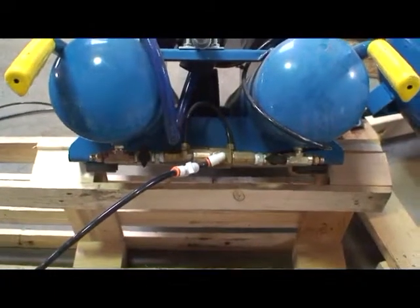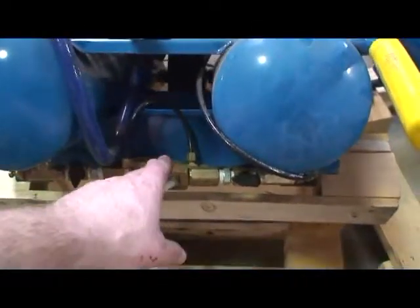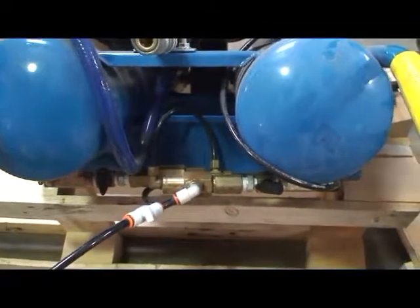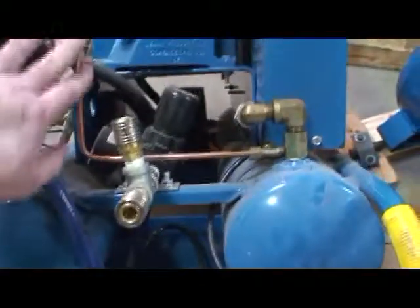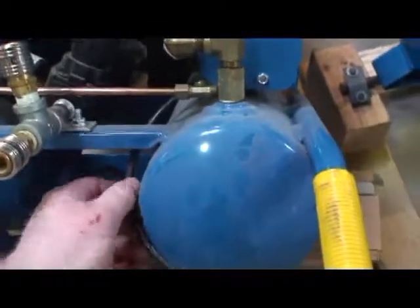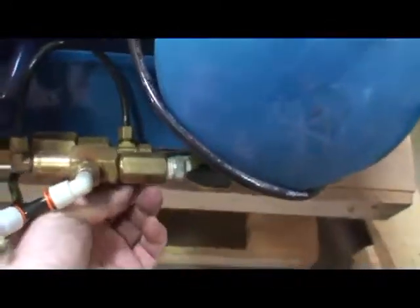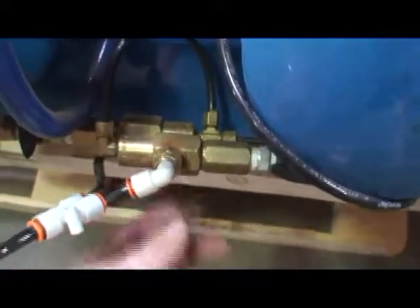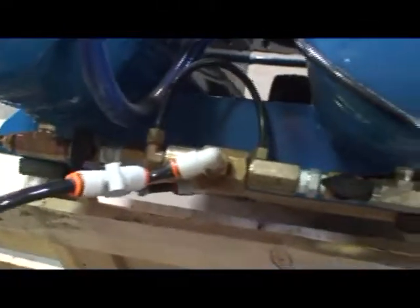Basically how these drains work is it takes an initial amount of air pressure to seat the valves inside of the pneumatically operated drain, and then once the machine reaches pressure in start-stop mode, it will send a signal impulse of air down the line, which comes down through this flexible plastic line down into the base of the drain right here in the back. That triggers these valves to send a momentary pulse of air out, which should carry effluent from the bases of the drains out this drain hose and into a catch container.